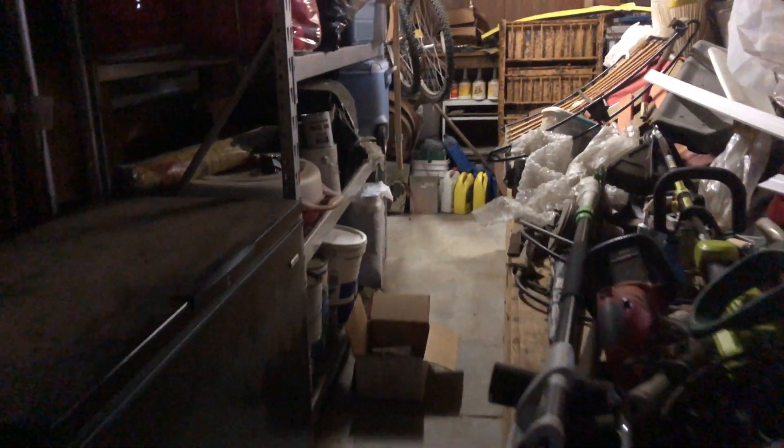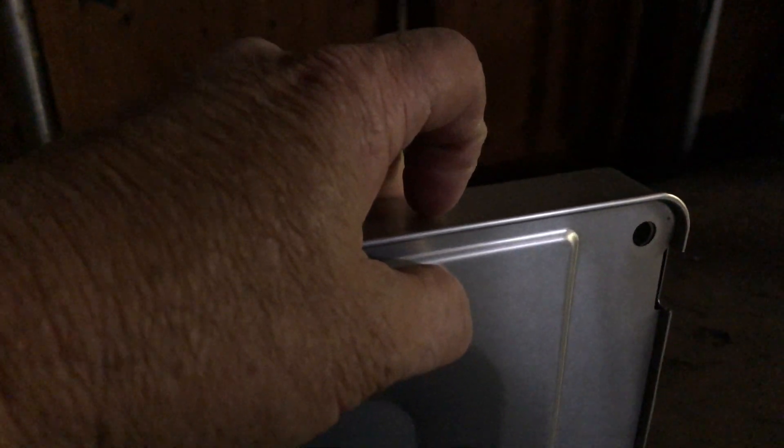Not the best light over here, but look at that — that module fits right in between our beams, and I can put two high and fill the insulation space with these modules. Seven high in series, two deep, in between each one of these beams, and I can build one hell of a power wall, then drywall over the top of it, and you would never know there are any batteries in there at all.